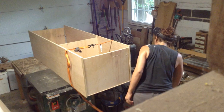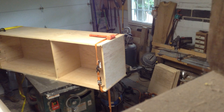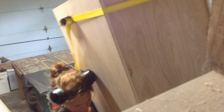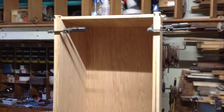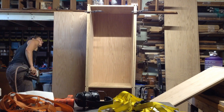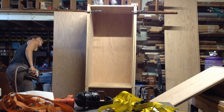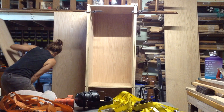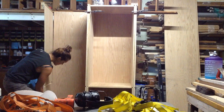These cabinets are one of those sizes that are just wide enough and big enough to be annoying to move around the shop. The glue-up section is heavily edited — it took a lot of finagling. For the other two cabinets, I clamped the panels to the side and assembled them vertically. I had the backer panel set into place, then added one side and assembled that way. Since the first cabinet was now square and dry, I let it dry overnight and used it as a reference to help square up the remaining panels.